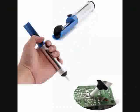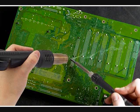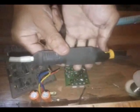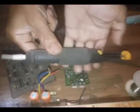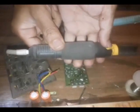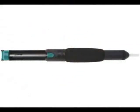Step 4. Troubleshoot problematic connections. It is common for numerous passes with the soldering iron and pump to be required before the component comes free. If you haven't made any progress after a few attempts, try any or all of the following modifications. Apply flux first to aid the flow of the molten solder. Melt a little amount of fresh solder to combine with the old, hardened solder. For through-hole connections, gently wriggle the terminal from side to side with the tip of the soldering iron. This breaks the connection to the hole's sidewalls.